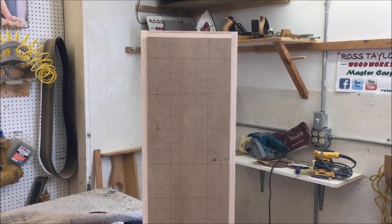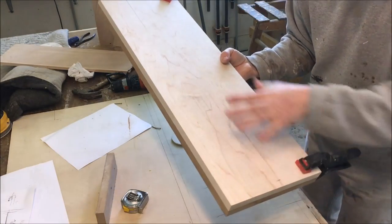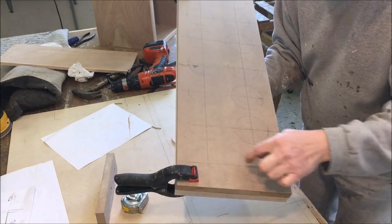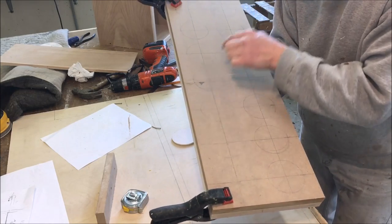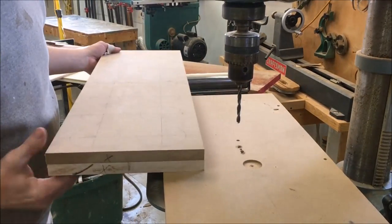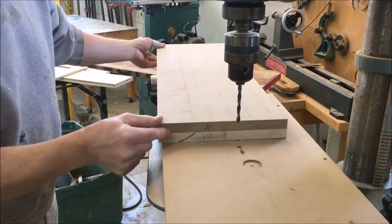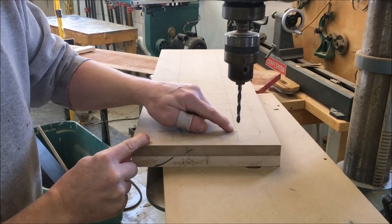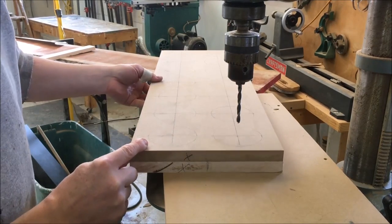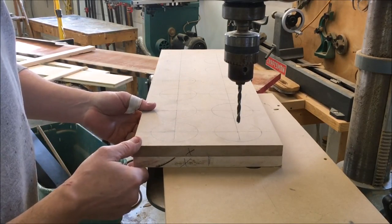The next step is to go to the drill press and start drilling those holes. I'm going to take the maple board and screw it to the MDF board. I'll drill pilot holes in the center of each one, and then drill those holes all the way through. I've got the drill press set up with a support on this end and the panels hanging off the edge. First I'll drill a pilot hole with a 3/16 inch brad point bit before I go to the hole saw, so the hole saw has a pilot hole to follow.